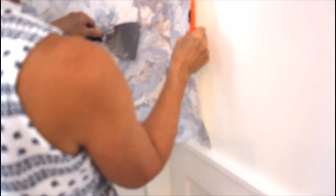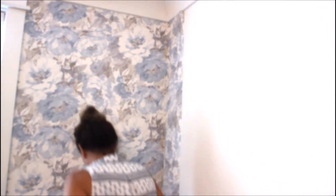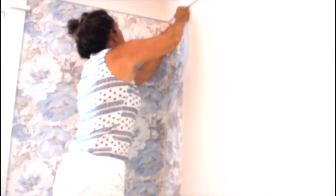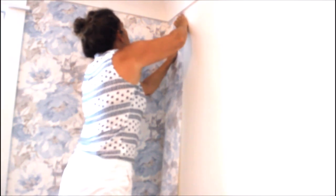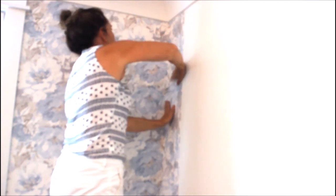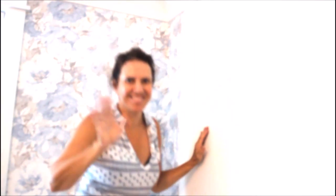This is the only time you're going to be holding something hard — you cut all the way to the top. Now that I've cut all the way to the top, I'm going to show you how easy the piece comes off, just to set an example. Now I can line up this piece with the other side evenly so that there are going to be no air pockets. It's going to line up nice and carefully, very even, and it's going to match with the other side of the wallpaper. This used to be one sheet of wallpaper which is cut down the middle.